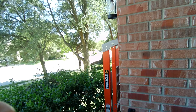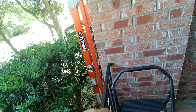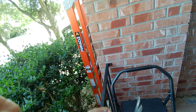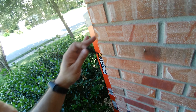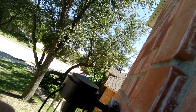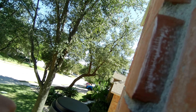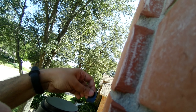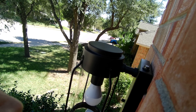I'm going to put a piece of electrical tape here — just need to cut a small piece. Hopefully this will prevent light from coming into the photo sensor and allow me to test if the light is working. That's the photo sensor, and in theory if I just cover it up to prevent light from coming in, it should activate and turn on this light.